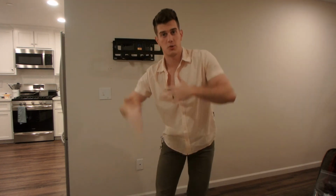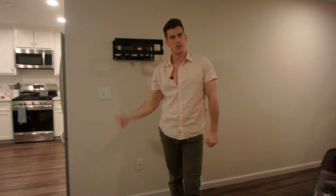I'm going to double check the measurement from the floor up, the ceiling up. Ideally, you'd have a level to put on this thing, because who says the floor is level? Who says the ceiling is level? Our house is a new build, so I bet the floor is pretty level and we could just measure right off of it. That's how I marked the studs in the first place.